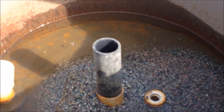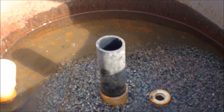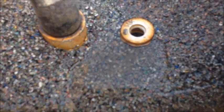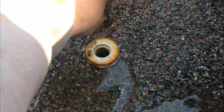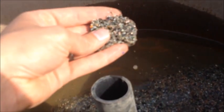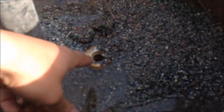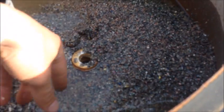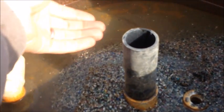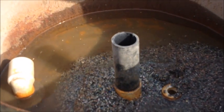This is really similar to a blue bowl for separating fine gold from black sand. It's a density separator, and you can see the material that we're regrinding still has some metallic values in there. And so they go down and regrind over and over in the system until the metals are liberated and the fine fiberglass floats up and out the top of the hydrocyclone.